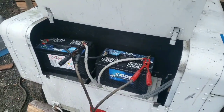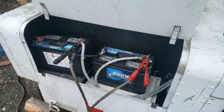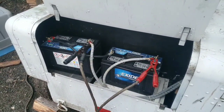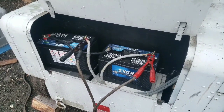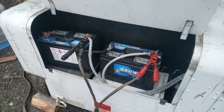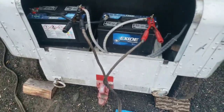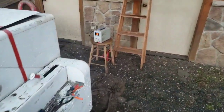Back here I got the batteries. It's supposed to take a 28-volt aircraft battery, but those were like $1,500 for the cheapest one. So I went to the tractor supply and got these — I think they were like $80 a piece — and I had to wire them in series to get 28 volts. And I got the charger back here just charging them up.